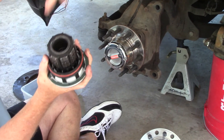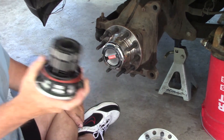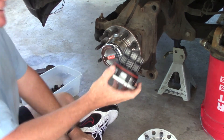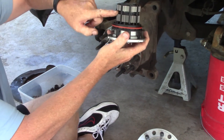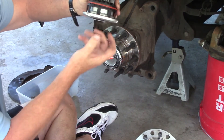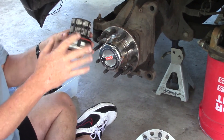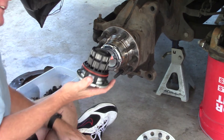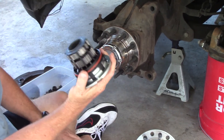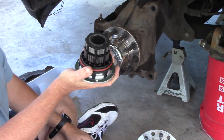I just moved that little gear a few thousandths, and it locks down. So you've got this happy medium of how big of a spring do I use here so that they disengage when the person uses his hand? Do I make it stiffer and make it even harder to turn? Light mineral oil or machine oil — WD-40 will make them a little bit easier.